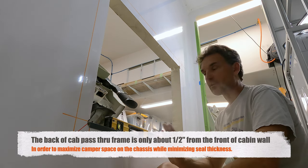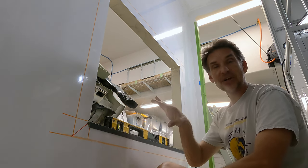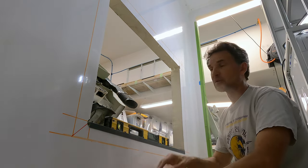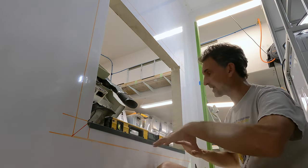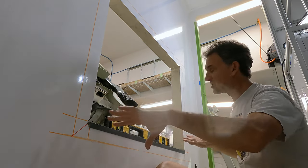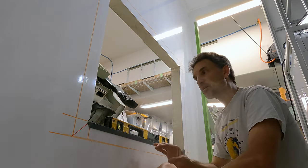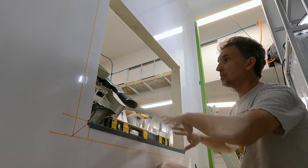Also, I want a really nice slippery material like this plastic, but not so slippery that I can't glue and adhere it down. So I made sure I chose adhesives that will actually adhere all this down, and they're also outdoor rated. We'll deal with the durability; it has a good enough hardness rating, impact strength rating, and tensile strength rating that it'll support knees and feet stepping on this and bridge across the platform here so it doesn't embed into the foam or crack the plastic at all. And at the same time, it's a plastic where I can also adhere my internal seal for my pass-through.